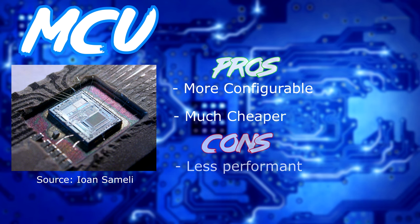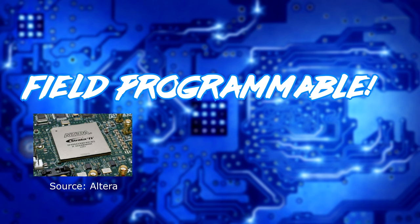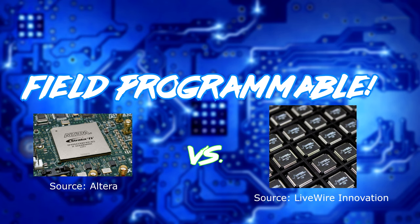One of the major advantages of an FPGA is actually in its name: field programmable. You can reprogram it if you make a mistake or if you realize it needs more provisions or features in the field. It can simply be reprogrammed and still perform to the specifications you want, versus an ASIC where you have to go back, remanufacture, redesign, and test — all while maintaining similar performance to what an application-specific integrated circuit can do.